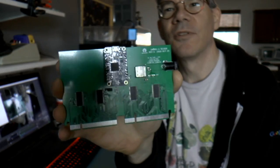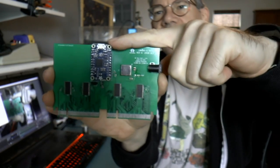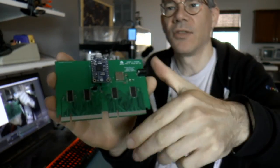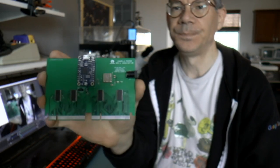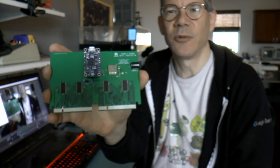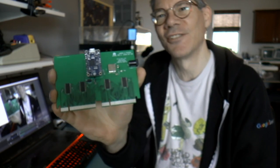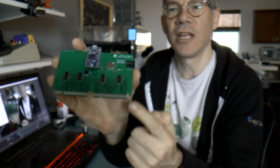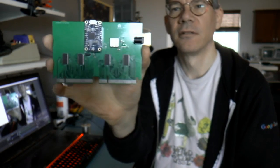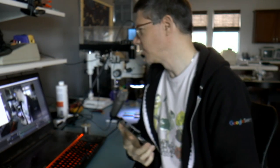There we go. So this is a testing board, and there is an Adafruit FTDI 232 board, which connects via USB, so you can control it from, say, a Python script. And basically it's just got either I2C output or SPI output or GPIO output, which is great. And then I've got these 4 chips, which are GPIO expanders. So they have 40 GPIOs each, and they will go ahead and manipulate and read all the pins on the backplane. So I can use this to test all sorts of boards.